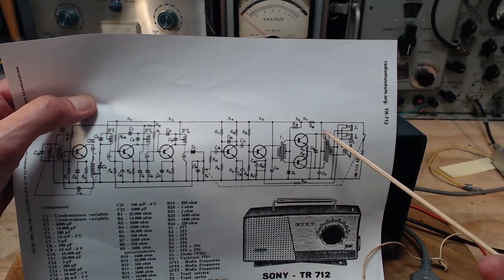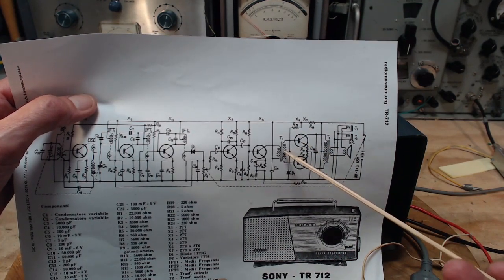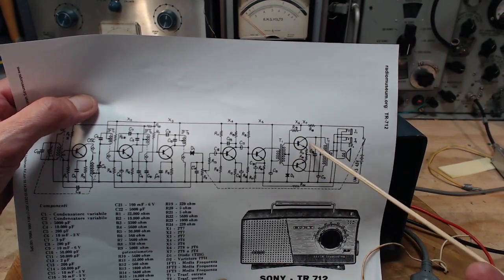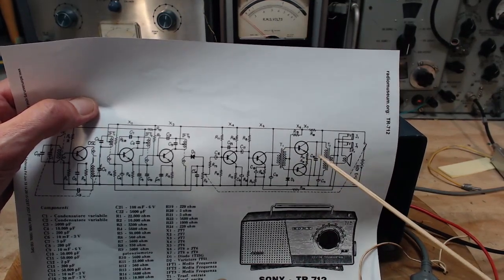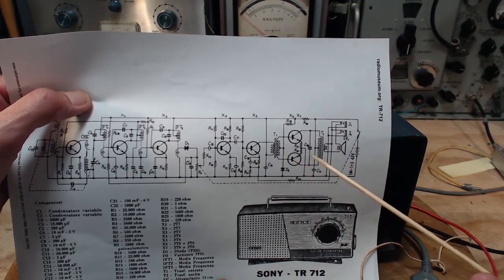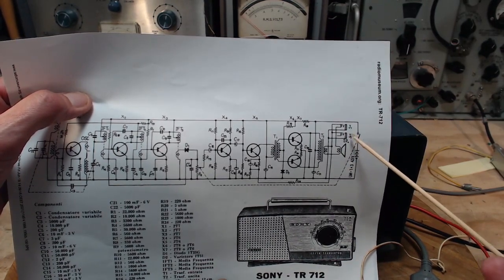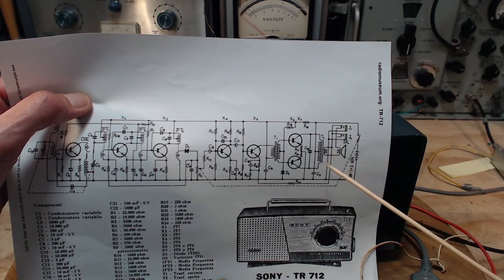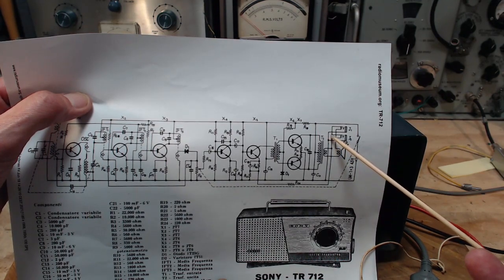And you're just dropping some here, and then you're feeding it here. Yeah, so the difference here between a vacuum tube and a transistor is that there is a base current. You have to feed a current to make the transistors work. So, well, not all transistors, but these ones are current devices. So then we got, here's the story on these two jacks. Why are there two jacks? Why would they put two jacks on here? So this is the signal, one jack, the other jack.